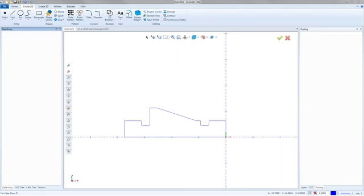The benefit of having a solid model for turning or even milling is the part that I create should be an exact copy of the final part, the part that I want off the machine. And so what I'm able to do is, as long as I drew my part correctly, I can show it as a workpiece, and inside the simulation actually see the difference between what I've cut and what the part file should be, according to how I drew it.